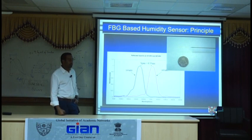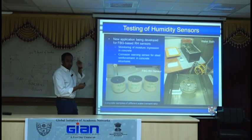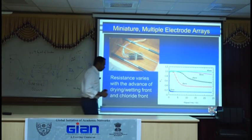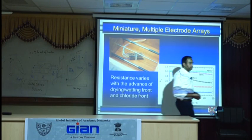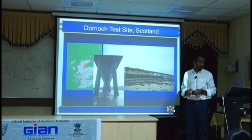Chlorides proved far harder to measure using fiber optics, and that's why it is not commercially ready — we've pulled the plug on that aspect. For moisture, however, it works well because the gels are very stable. We then developed a humidity sensor using the same fiber optic grating technology. Data interpretation depends on knowing the initial wavelength and tracking the change — all sensors need to be calibrated before deployment.